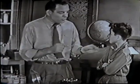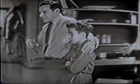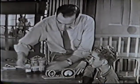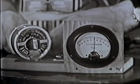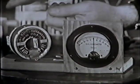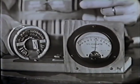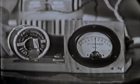Is that your circuit breaker? Using alternating current, you don't have to have the circuit breaking idea. In fact, remember when we put this magnet in the coil? When we had a magnetic field that was moving in this direction, we got a current. Now, if we have alternating current that goes back and forth, and the current is first going in one direction through a coil and setting up a magnetic field, we have a buildup like this. A surge like that. And we have a current. Now then, the current turns around and goes the other way.